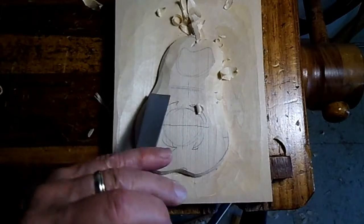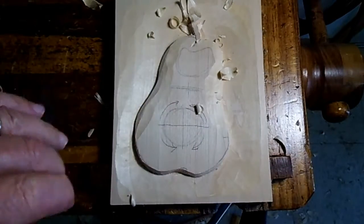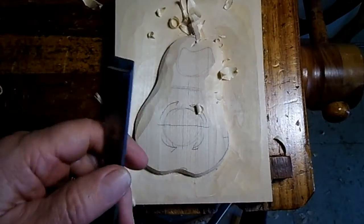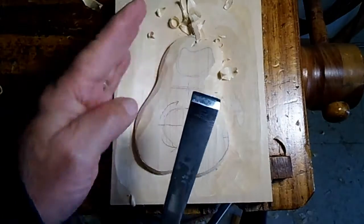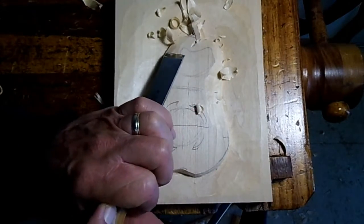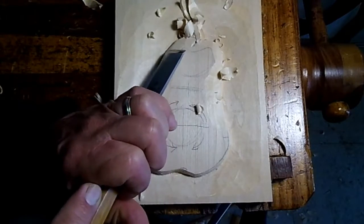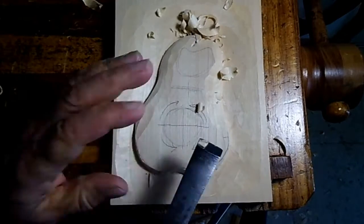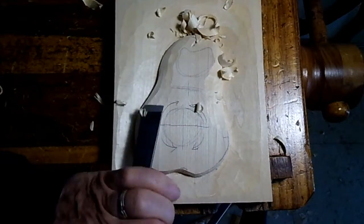So you have the first way, which is right side up. You have coming right down for a plunge cut. And the third way is upside down. So we're trying to make it curve like this. So it stands to reason that we would start our rounding off pretty good by using the chisel upside down. So that's the third mode of operation for the chisel.